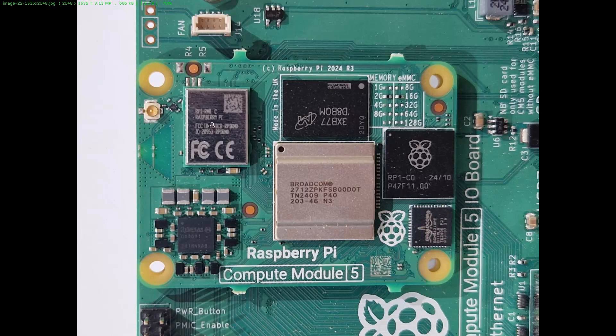Let's get back to this Wi-Fi Bluetooth controller. We see that this has been added. This is an external antenna connector and this is a selector — it can either use the internal antenna. This is the same as on the Raspberry Pi 5, but this external antenna connector is actually missing on the Raspberry Pi 5. You can watch my video to see how you can make it yourself. You simply connect two pins together and cut the line to the internal antenna, then connect an external antenna and it will work with your Raspberry Pi 5.